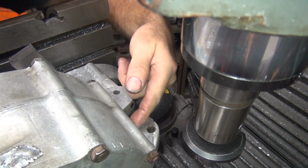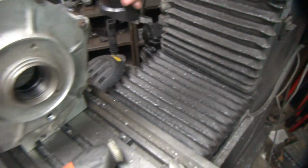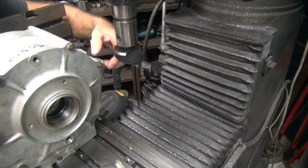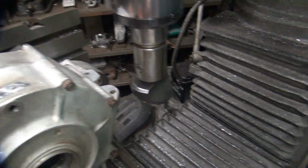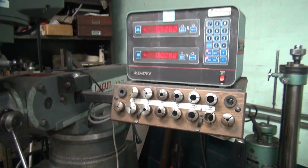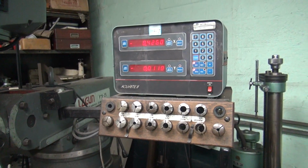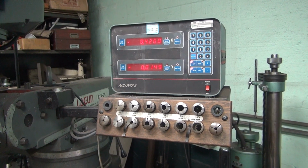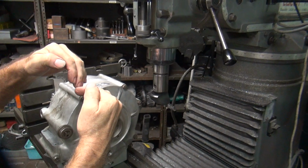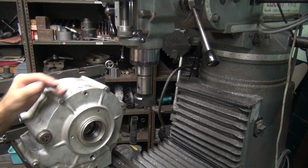Whatever they did. So this has a sharp edge on this cutter, doesn't it? Yeah, there's a little bit of radius, but not much. So what I'm doing, I'm pulling back a little bit to act like a radius. So I pulled back 5. I'll pull back 10 thou this time, I think. 15. I'm stepping it there so I don't leave a real sharp point like that. I'm pulling, trying to make a radius on a non-radius cutter.